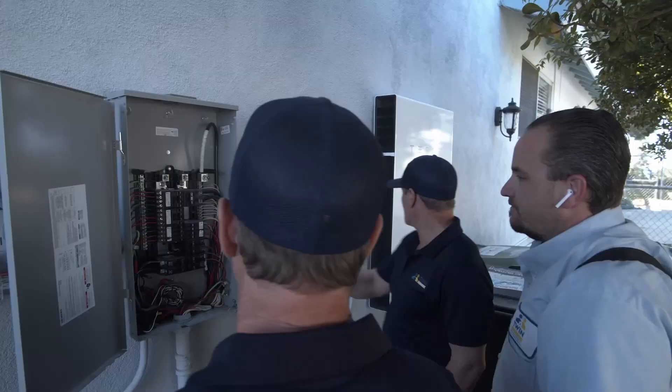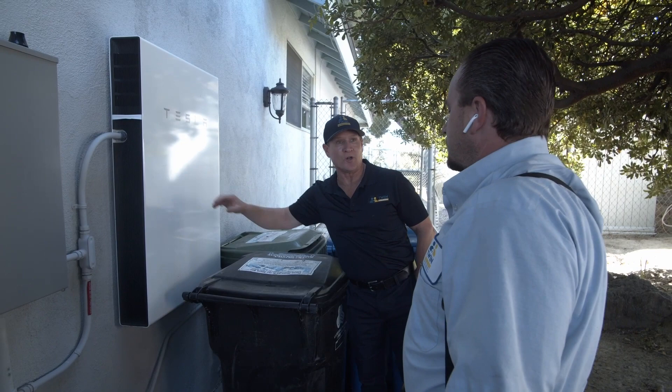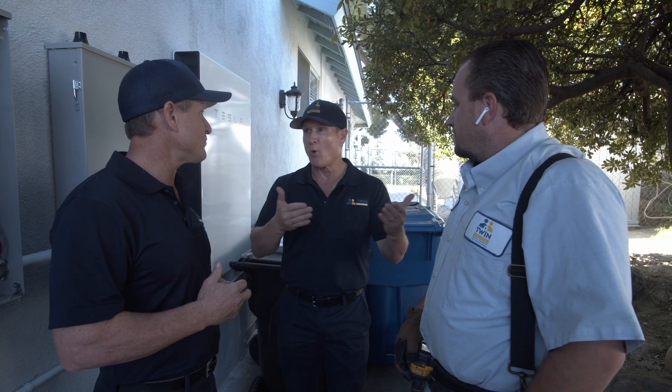This is the Tesla Powerwall Pack system here - pretty innovative, one of the best systems on the market. On the hybrids, there's either a 50-gallon - because he's got a 50-gallon gas right now - or if we go with either Rheem or Bradford White, they make an 80-gallon as an option. He said he wants to move up to the highest demand water heater possible, so that's going to be the 80-gallon. An 80-gallon would be sufficient for three full baths.